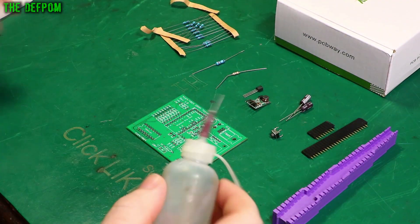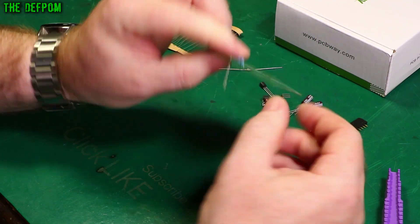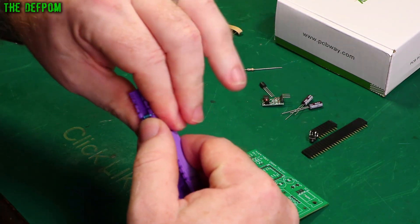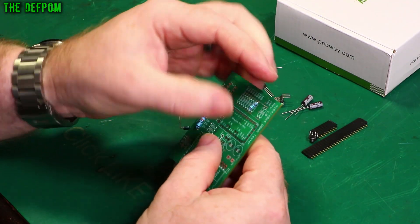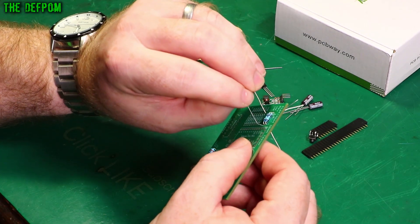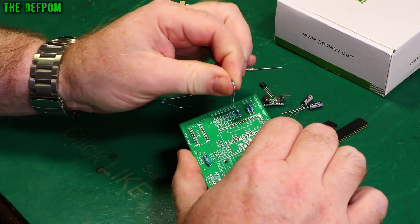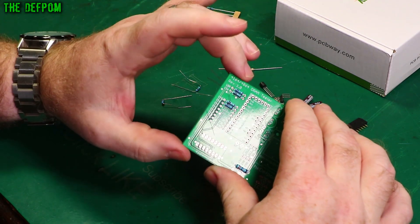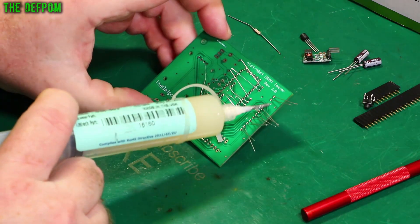To start with I'm going to clean the PCB with some IPA, just to make sure there's no oily residue or anything on it — just helps the soldering process a little bit. No forming required for these ones — these are the wider ones. I'm making sure these are lined up, putting the bands the same way around as the markings on the board so the colours on the bands match. When you put the parts in, they're all the same all the way down — you have to make sure you do that. So that's all my resistors soldered on there; these are the ones that lay down flat. I'll flip it over, put some flux on it — probably don't really need it, but it just helps slightly.